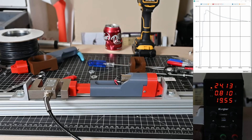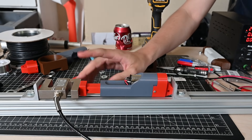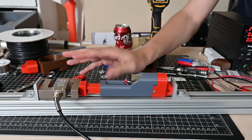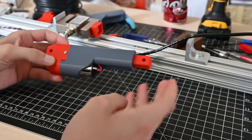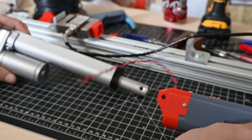All right, so it's holding about 230 to 240 pounds. That's about the max capacity of this load cell, so we shouldn't really trust numbers over the 220 pounds or 100 kilograms it's rated for. But I think it's fair to say that this linear actuator can push with 100 kilograms of force. We successfully made a 3D printed linear actuator with very similar capabilities to a store-bought one.